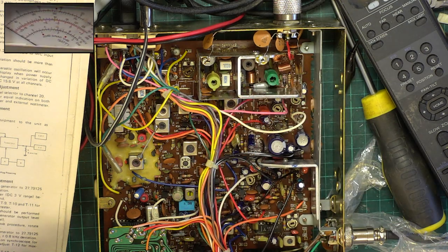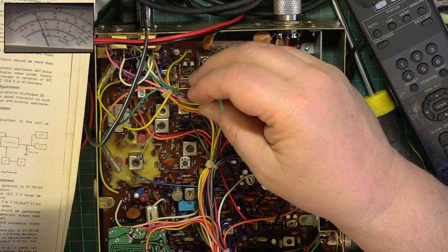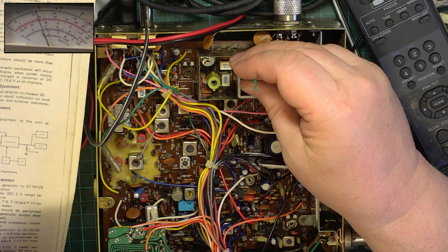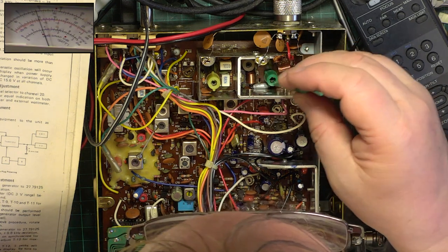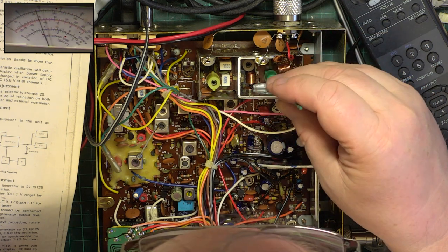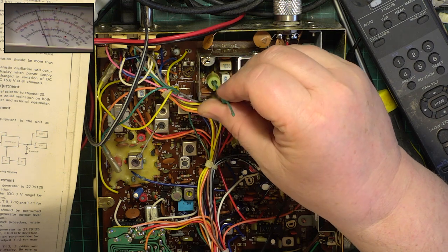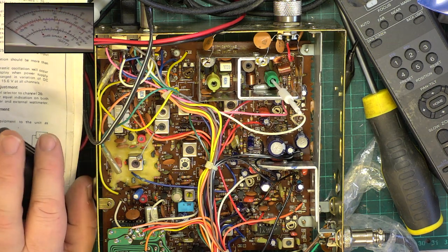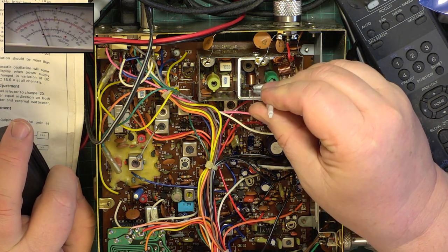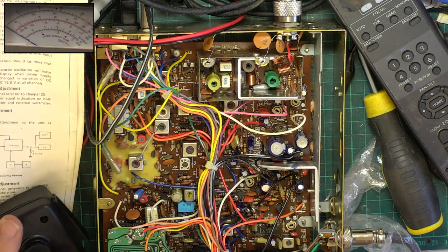So the trimming tool's on the floor where you'd expect it to be. So going to transmit. Maximum. The one I was worried about has moved, so maximum. And the one which I didn't worry about, we can't move. I think it's got some wear on the inside where someone's used the wrong tool. So we'll now have to use the wrong tool too to grip it. So there we are, we have 5 watts. So that's everything maximum.